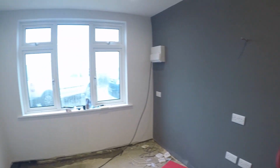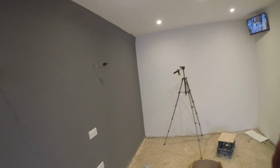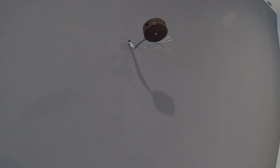So what next then? What are we going to get done now? Well, I reckon, as I'm kind of bored of just working inside the office, providing I've got the materials, why don't we sort out these two lights? Now, they're going to have to be something with a base that sits on the wall, because I need somewhere to put the connections, because you can't just stuff connections back in the wall. Well, you can, but you've got to put them in proper little connectors. And again, that means I need a base that would cover that size hole, so I'm going to need a base no matter what. So either way, we can fit it, but we need some kind of base to fix it on the wall. Now, I know there's timber behind them, because obviously we put timber in and wired it.